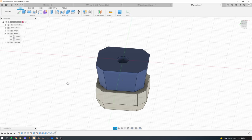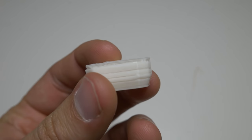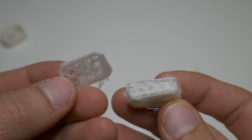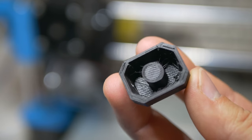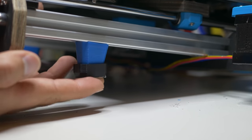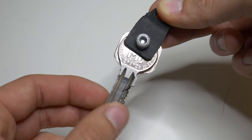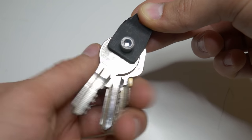Since this is a direct extruder, flexible filament should be easy to print. I printed a flexible piece for the printer foot and the first try was close to a good print, but the second and third tries were a disaster. I'm probably doing something wrong and still need to experiment with settings. Since flexible filament wasn't working well, I switched to PP — a material I like a lot and use often. For example, I recently designed and printed a minimalistic key holder, which is a perfect thing to print with PP. Link on Thingiverse in the description.